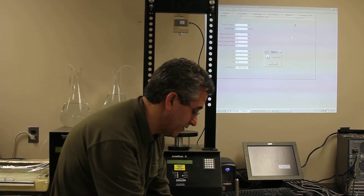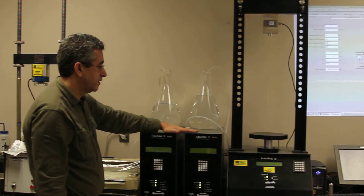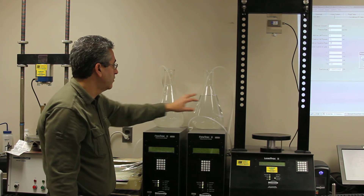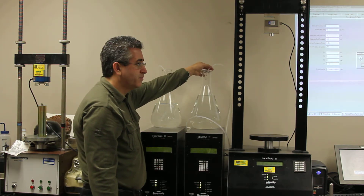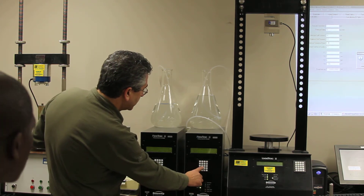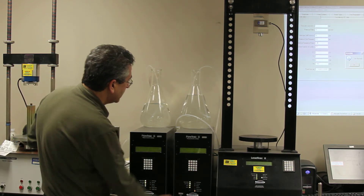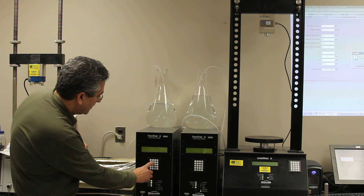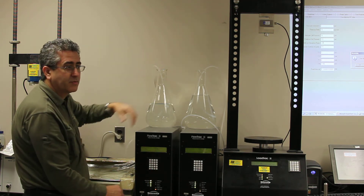After that, we're going to release the two pressures that are inside the flow pumps from the end of the test. The best way to do it is to release them into the water supply. If I open the supply valve, you're going to see the pressure release through the quarter-inch tubing. So I go to the keypad — position, number five, then supply valve — and the pressure has been released. I do the same thing again: position five, then number three. You can see the tube here when you release it — the pressure has been released.